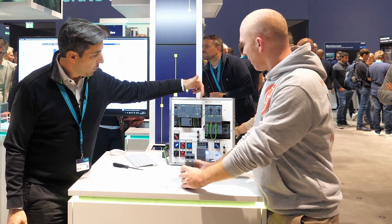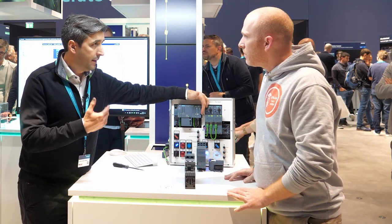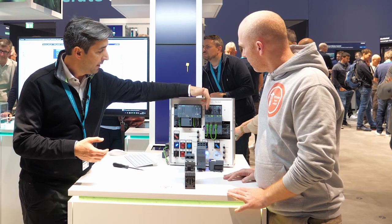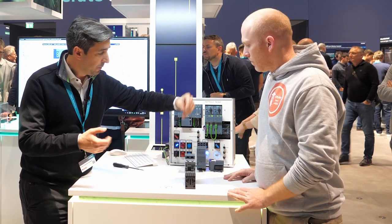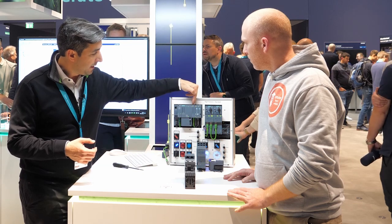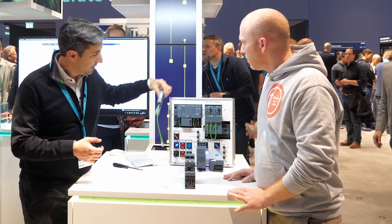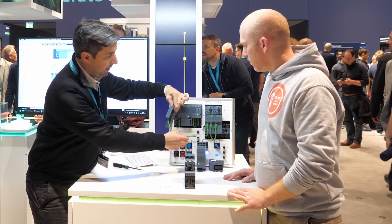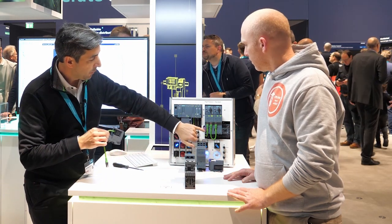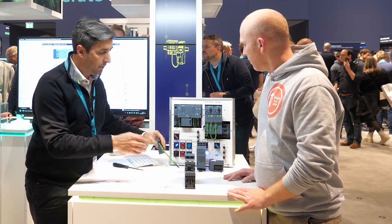Yeah, basically you don't need anymore the inputs and outputs that you normally need for the contactor and the circuit breaker. You just connect this module like I showed before, and you go with this communication in the extension rack from the ET200. So this module that you can see here is also an extension rack, and this goes from module to module up to 16 devices, and you have to provide the 24 volt power for the module.